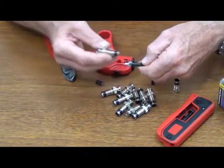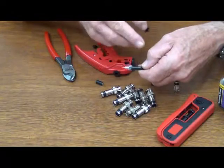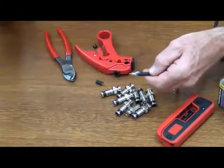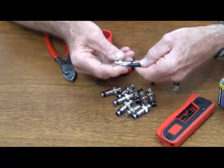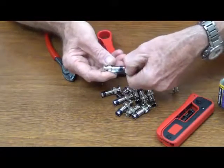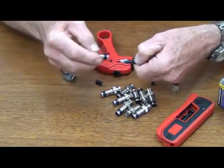The other important factor is when you push this connector on, you want to make sure you're down where you belong on the cable. Because if you're not, you compress the connector, you do your pull test, it comes off, and you've got to throw it away and start over — and that's an expensive mistake. So what you want to do is set it back there, look at your center conductor — we're good — and then notice the end of the connector and put your thumb right there. That's where you need to be on this cable.